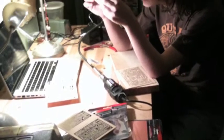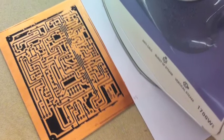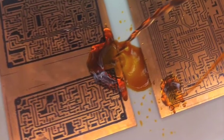I ordered parts from suppliers around the world to find exactly what I needed to make the synth, and they finally arrived. I began the long process of building my own circuit boards from scratch. First I had to etch the copper. After a lot of failed attempts with transferring the image, I finally managed to get it right, and I etched six boards.